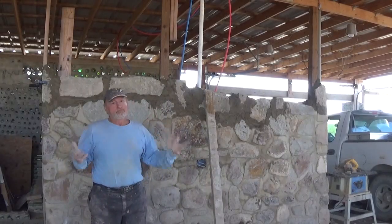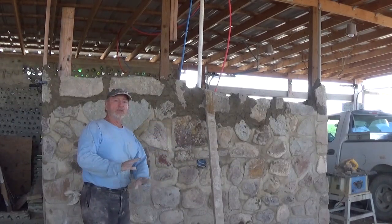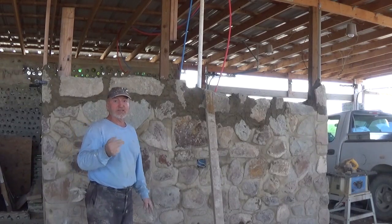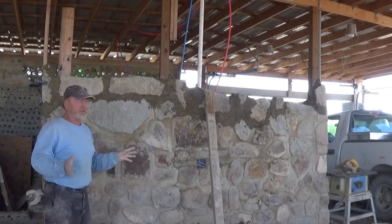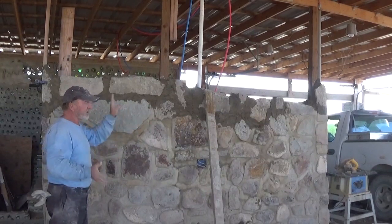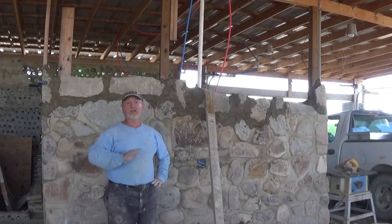Creating a little bit of adhesion from going all the way around — it's not enough to hold the rock in place on its own, but when you set one right next to it, that will lock this in better. It's not like glue, but it's that adhesion, that cohesion from surface tension. It'll hold together, and I'll come back when I finish this load of mortar. A quick rudimentary fundamental lesson in stone masonry — we still have a couple of things to do. I can do about 25 rocks a day, and we'll come back to show you the pointing.